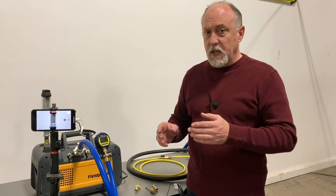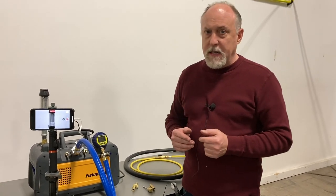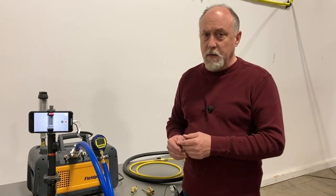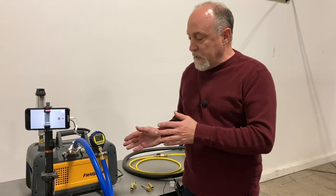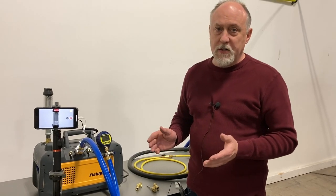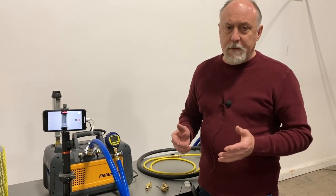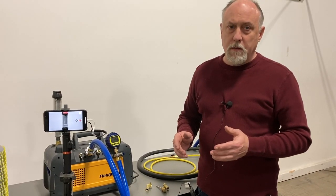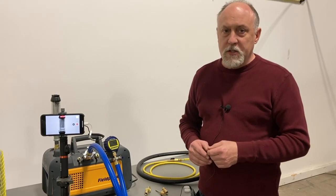A lot of guys don't understand that. Both hoses will really get you degassed quickly, but True Blue is going to get you dehydrated and into a deep finishing vacuum a lot faster. Anyway, I thought you guys might like to see this — it gives you an idea of what you actually see with flow in a vacuum. If you've got any questions or comments, please feel free to leave them below. Like and subscribe to our channel to see new feeds come in. This is Jim Bergman on behalf of AccuTools. Thanks a lot for watching.